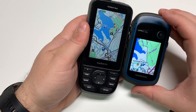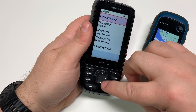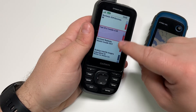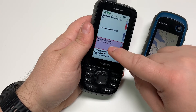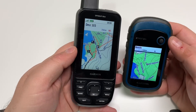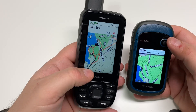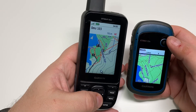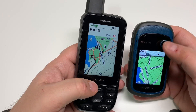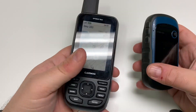With the SD card loaded and the device booted, it looks a lot different from the eTrex 22X already. If the map doesn't display the way you want, go into Menu > Map Setup > Configure Maps, where you can turn map layers on and off. I'm going to turn off Topo Canada 2.0 — it's not great — and enable Backroads Maps Atlantic Canada. Now I have both products visible: the Garmin Topo Active and the purchased Backroads Maps. The topo detail is more pronounced and the main trails are identified, but OpenStreetMap has a bit more information.